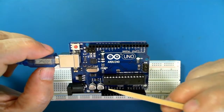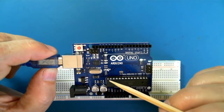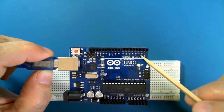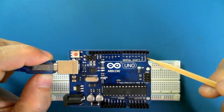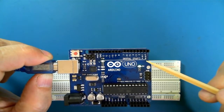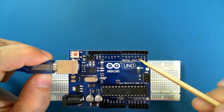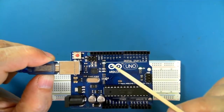There are 28 pins on this chip, and you can see there are 14 of them exposed. It doesn't matter which ones on the actual chip are connected where. The only thing you have to worry about is getting the pins right on these two headers. Digital pins 0 and 1 are used to communicate between the Uno and your computer. Pins 2 to 13 are available for you to use as either inputs or outputs.